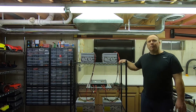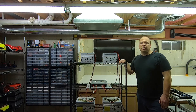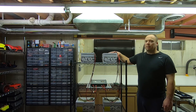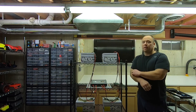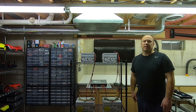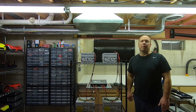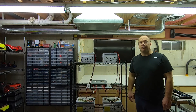That freaked me out — I don't want to burn my house down. So I started looking into the best way to store lipo batteries and came across these bat safe containers. Before that, a lot of guys were using ammo crates, and that's fine — it'll probably keep your house from burning down — but the smoke damage will still destroy your home. This is a little better.